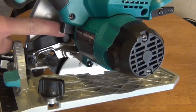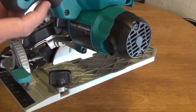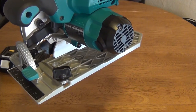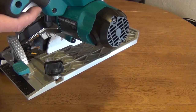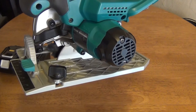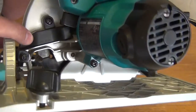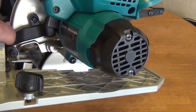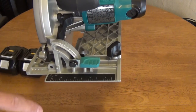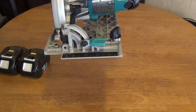There is a thick piece of plastic here. What it does is take the hot air from the fan on the armature — as the motor spins, those blades push airflow out of the motor to cool it. This plastic shroud redirects some of that exhaust air into the area of the saw, blowing sawdust out of the way so you can see your line.